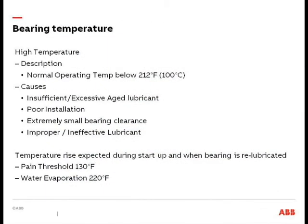Regarding bearing temperature — the pain threshold is about 130 degrees Fahrenheit, and that is a perfectly fine operating temperature for bearings. Most bearings are rated for up to about 225 degrees, and generally the limiting factor is going to be the grease or the rubber contact seal lips. If you put your hand on a bearing at 130 degrees, you're not going to be able to hold it there very long — but that's fine. The easy test: if your spit sizzles on it, that's a problem. If it doesn't, you're fine.